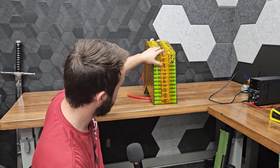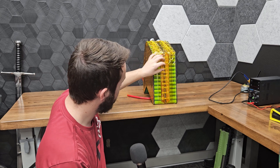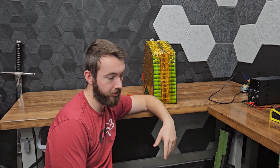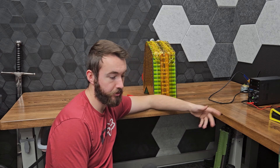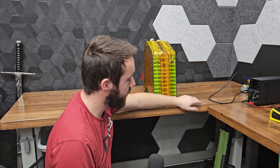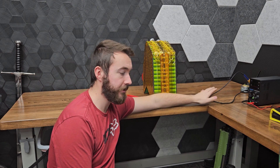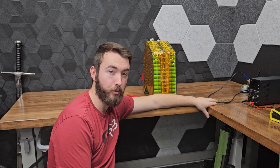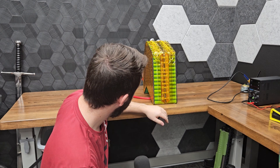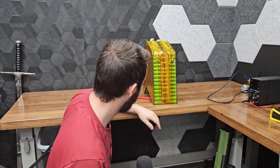I thought about putting my battery halves on opposite sides so these would fold around the outside and then have connections across there, but that's a long way to bridge that series connection. Especially compared to all the other ones, I didn't want to deal with that because the longer it bridges, the more resistance you build — it's equal to having a smaller amount of copper. As far as folding goes, people don't usually fold their nickel connections many times because it's bad for them. I ended up folding this thing together probably four or five different times with no issues. It didn't seem to weaken the connections at all — it looked really good the whole time and was solid enough to brace it, working really nicely as a hinge.